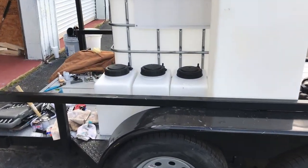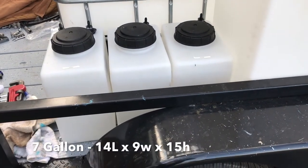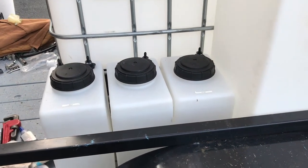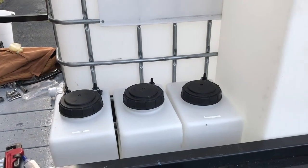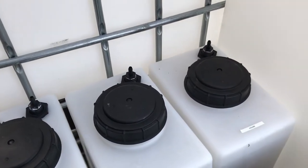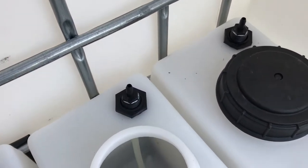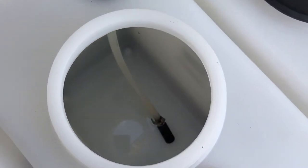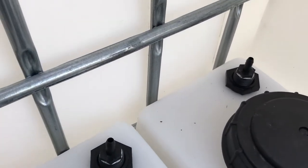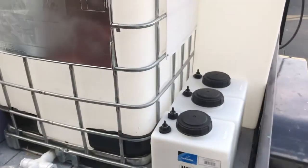The other tanks we're looking at: we have three 7-gallon tanks that we're going to use for our roof cleaner, house cleaner, and general surfactants. We generally pull into our metering system off of these. The way we do that is we put in a half-inch bulkhead with a quarter-inch valve, and inside the tank you can see we go down to a filter or strainer that leads up a quarter-inch tube to the bottom of the bulkhead. From there we configure everything going to our metering system.